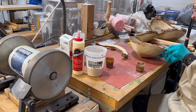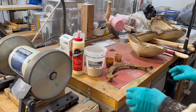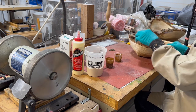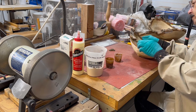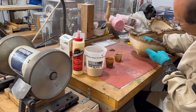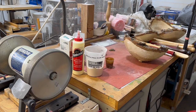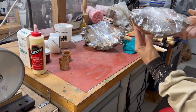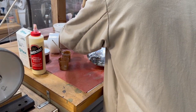This is the first time I've tried to glue a piece of bark on — normally I probably would have just taken the bark off the entire piece. After I put the bark on, I took some wrap that movers use — it's just a thin wrapping material — and used it to basically secure the bark on there, because I didn't really have any other way of clamping the bark down. That seemed to work pretty good.